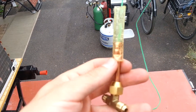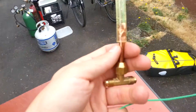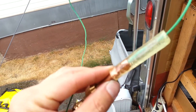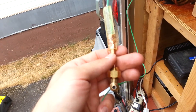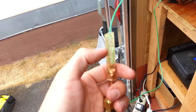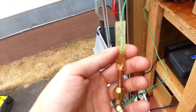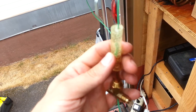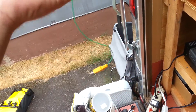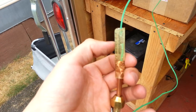I make a short little stub to flare it. I crimp the copper a little bit to get a good mechanical adhesion between this epoxy casting and the copper, and I place the sensor down inside, measure it to where the top of the copper is, and then pick a small spot, about three quarters of an inch, and shave the insulation away. Because if you don't, gas will pass right through that insulation, along the wires, and all the way out to the plug and leak. So that's why this casting has to be so long.